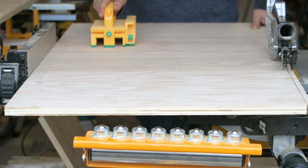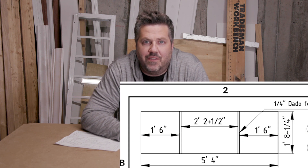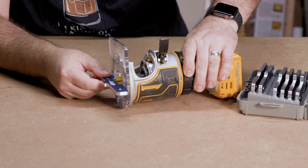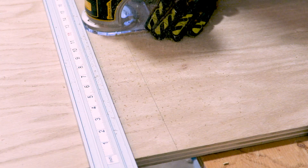Let's start with the bottom piece of the cabinet. We'll cut it to the correct width and depth, then prep it for the inner panels by cutting quarter-inch dados on the left and right side. We'll cut the dados using a router by laying it up against a straight edge and running it across to cut a dado straight through. The bit I'm using is called an undersized plywood bit — it's just a few fractions of an inch smaller than the actual three-quarter inches of the plywood. I'll use a Kreg setup bar to set the router bit height at one quarter inch. When routing, use the round side of the router against the straight edge — if you use the flat edge and move it even slightly, it will lever off the straight edge and your cut will be crooked.